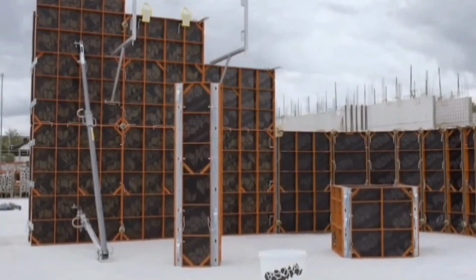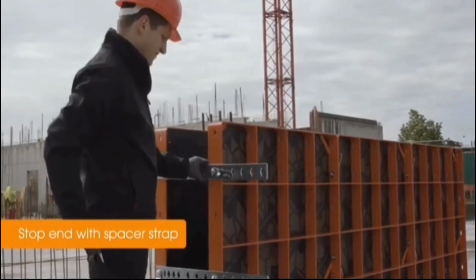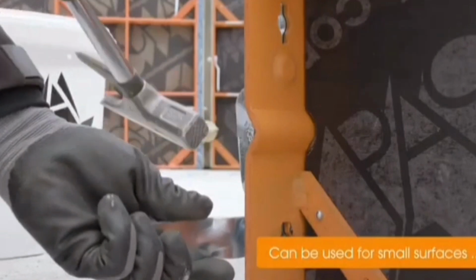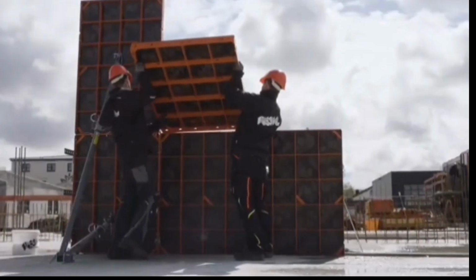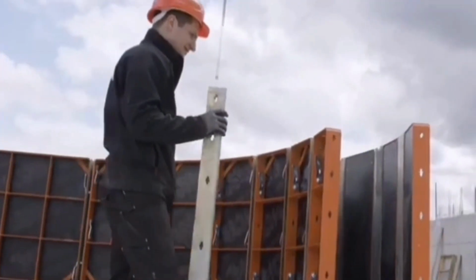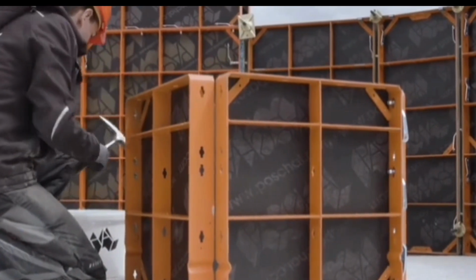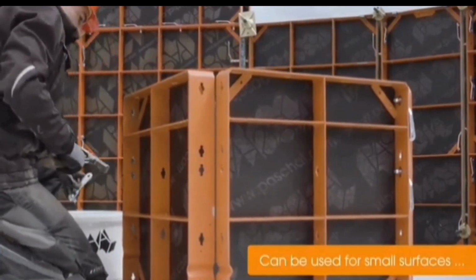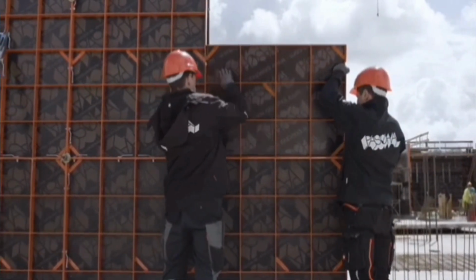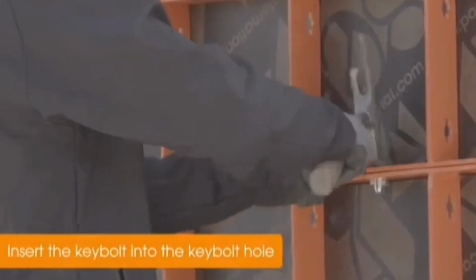Here is another formwork option, this time from Germany. It's a versatile modular solution from PASCHAL suitable for even large or complex projects. It's made of steel and lined with 0.6 inch thick, 11-ply birch plywood. Segment height reaches 108 inches for the maximum concrete pressure of 1,253 pounds per square foot. A wide range of elements and a universal screw connection solution make it easy to work with foundations, shafts, supports and purlins of various configurations.